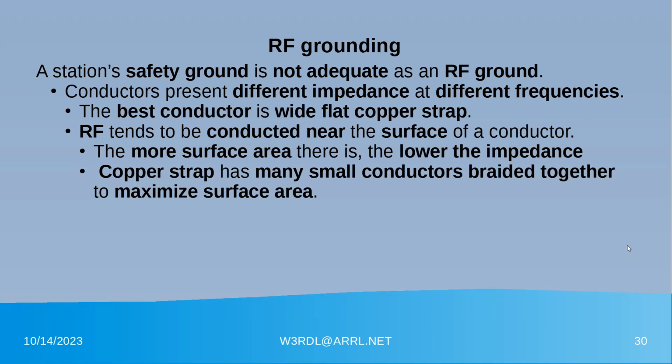But you don't use the braid off of coax. I know. I was just trying to use that as an example of what I was thinking of. But that's an example of what you shouldn't do, take some old coax and pull the braid off of it and use that, because for one thing, it won't be tinned and it's very fine wire and it doesn't work well. And outside, it doesn't work at all. That's why if you get a water leak in the jacket of your coax, it kind of wrecks it. The copper corrodes very quickly.